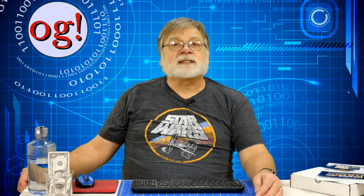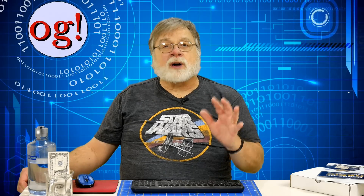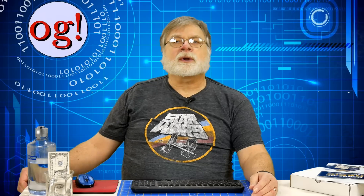Fortunately, using the new audion and triode tubes back in the late 19-teens and early 1920s, a far better way to create RF was found using vacuum tubes. Unlike the terribly inefficient spark, a vacuum tube oscillator could create a nice, clean, continuous wave on a single frequency. This allowed much more efficient use of spectrum space, allowing hundreds of transmitters to operate where only a few spark stations could be. Just like the spark signals, the continuous wave oscillator outputs were keyed to create international Morse code. To this day, we mean Morse-keyed continuous wave when we use the abbreviation CW.